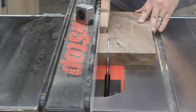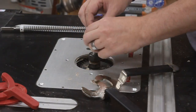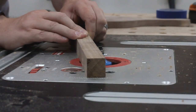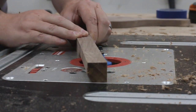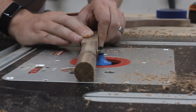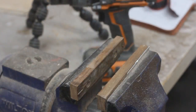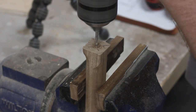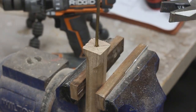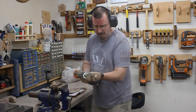Next up, I need to create a dowel to fit in that hole. I start by ripping down a perfectly one-inch square piece of stock on the table saw. Then I can chuck in a half-inch round-over bit into the router, and take off each of the corner edges of the piece I prepared. I made sure not to do the whole thing, but rather to leave a portion of it still square — this just makes things easier since I'm not trying to push the whole piece past the router bit. The band saw takes off the half I don't need, and then I can drill a hole into one of the ends for a long screw. I drive it in a ways, then clip off the top half of it since I was feeling rather destructive, and this satisfied my rage. At this point, I could chuck it into my drill and sand it down just a bit until it was a perfect fit into the hole of the paddle.